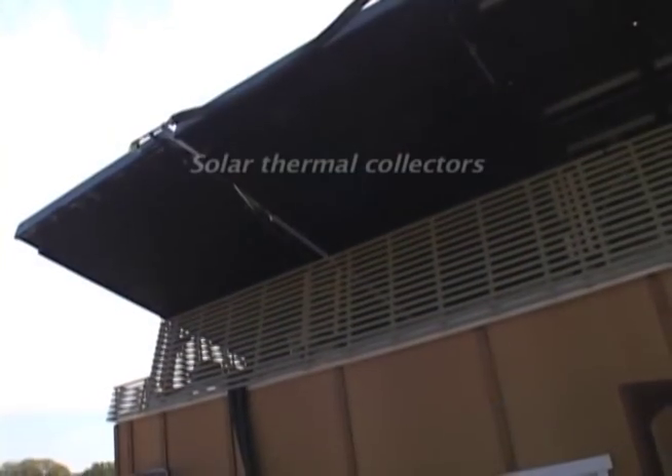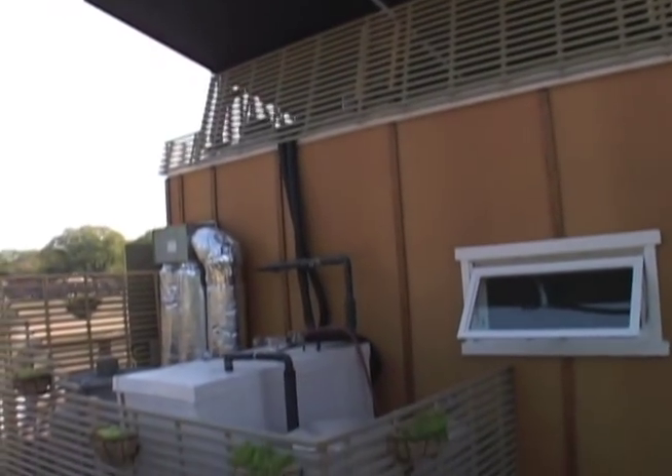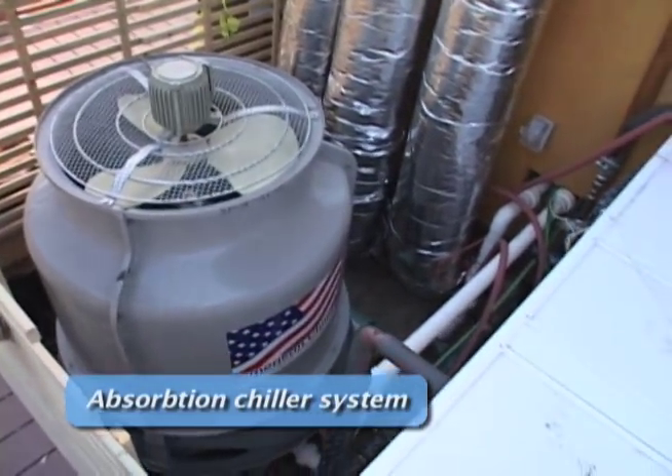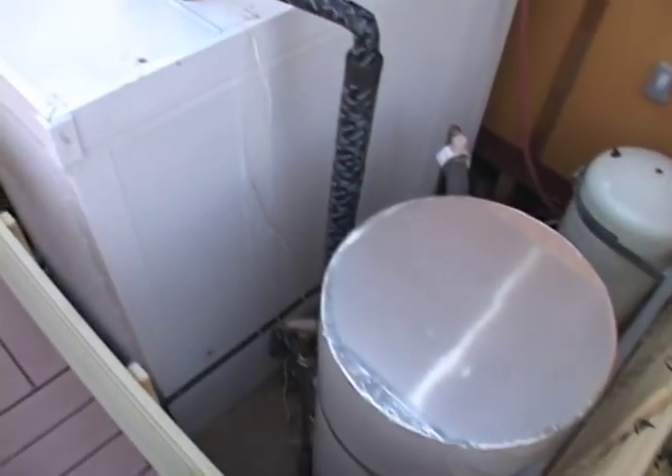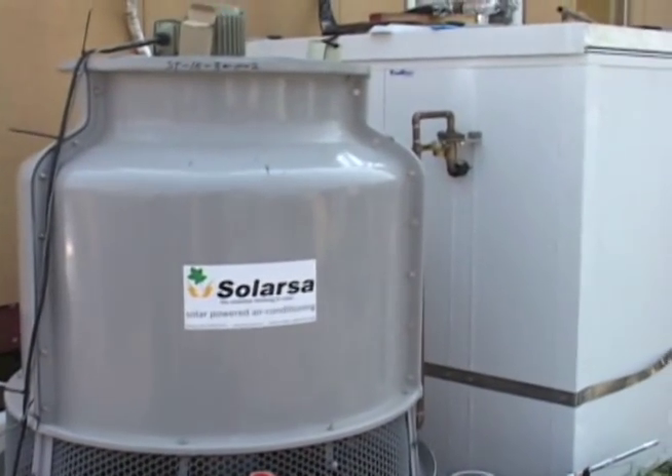This is our most innovative feature, yet it's very simple. It is an air conditioning unit that instead of using electricity, it uses hot water. The way this works is we have thermal collectors on the roof that collect very hot water. This hot water is then stored in a hot water tank. We use that hot water to heat our house, heat our water for showers or appliances, but also to cool our house. The way we cool the house is with an innovative machine called an absorption chiller. The machine takes hot water, mixes in lithium bromide salts, and that brings down the temperature of the water to almost freezing temperature. This water is then run through a copper coil, you blow air through it, and you get air conditioning. The beauty of this system is not only that it uses very little electricity — air conditioning units are huge power-hogging devices, and it's the reason most power grids go down in summer — but it also works best the hotter it gets. So it's ideal for hot climates like California, Florida, Arizona, and Texas, because the more heat you get, the more cooling you get.